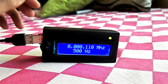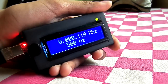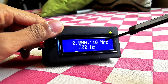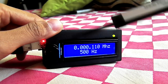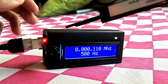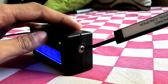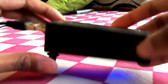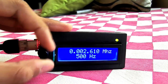Hey, what's going on guys, it's Keda here and here is my new 0 to 30 MHz frequency generator. You can see its size — it's quite portable and runs off USB. There's a power LED, a 16x2 Hitachi LCD, a rotary encoder, and I used a CP2102 USB to serial converter. I used an Arduino ATmega328 at 16 MHz. On the output side I connected a 3.5mm audio jack and used this laptop charger casing to enclose it.